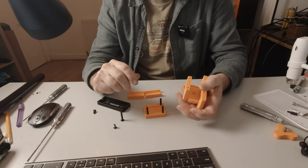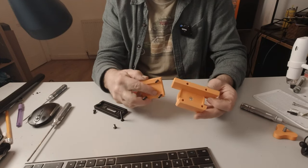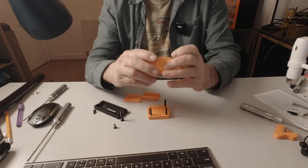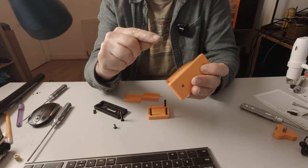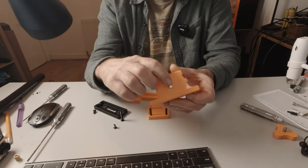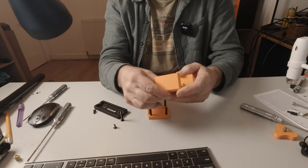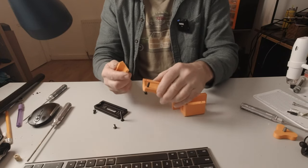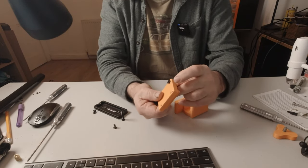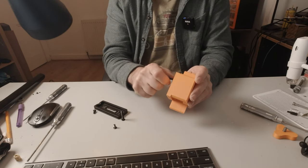To assemble the dynamic counterweight carriage, find parts 41, 42, and 43 — part 43 being two sleeves. Using a soldering iron, press a small M6 threaded insert into the top of part 41. Take one sleeve and place it inside this part so it fits inside. On the other part, put the sheath in, then take four M5 low profile bolts and bring the parts together, driving in the four bolts.